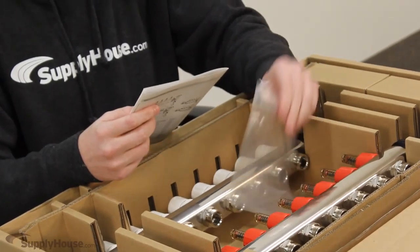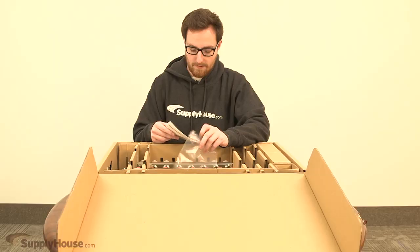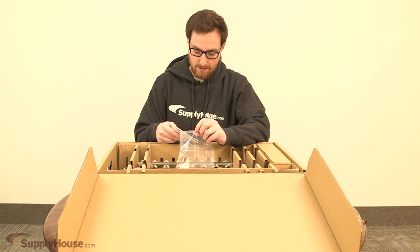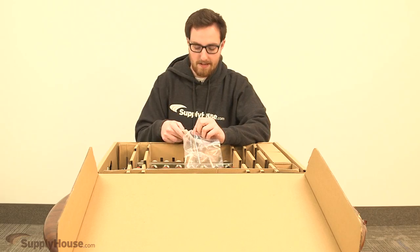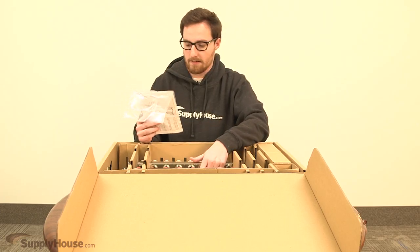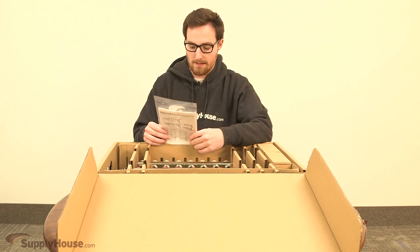You've got to be careful though — a lot of this is in metric still. Rather than CV it shows the KV, which is the metric equivalent, and they've got a lot of strange thread sizes. A lot of it is BSP rather than national pipe thread, so you can't just screw a regular fitting onto the connections of this thing.